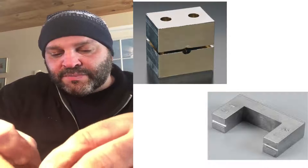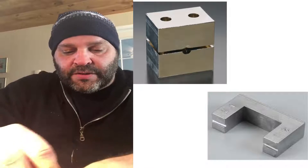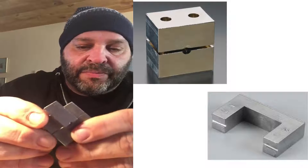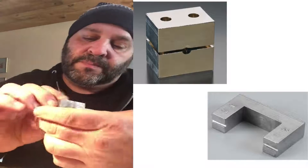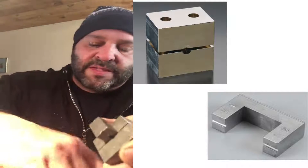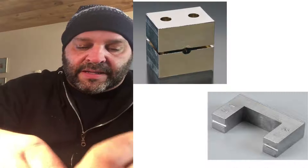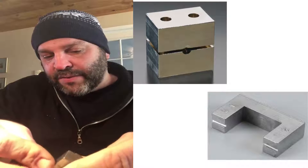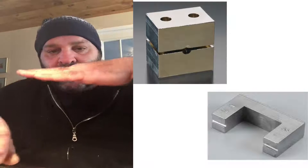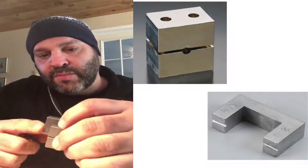There's also another part to this tool — a piece that goes on top. You put it on your block and there are two sides: one side marked 25 and the other marked 15. You put the nail inside, place it on a hard surface, and bang it with a hammer. What it does is bend the nail slightly — instead of a perfectly straight nail, you can bend it a small or large amount controlled precisely by which setting you use.